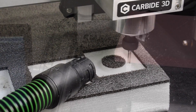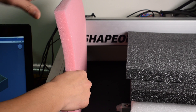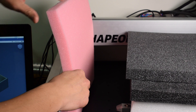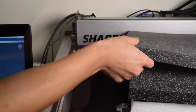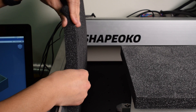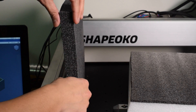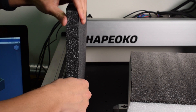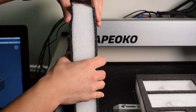So let's oblige my curiosity and see just what's possible on a Shapeoko. To start off this experiment I bought a variety of foams - some polyurethane examples and some polyethylene types. I have some pink anti-static polyurethane foam; this stuff is about 1.4 pounds per cubic foot, very light and very soft - think sponge. I also have some 2-pound polyurethane, which is substantially more rigid but still very compliant. Then I bought some 2-pound polyethylene foam, much more rigid and similar to what you'd find in a lot of consumer packaging or pool noodles.